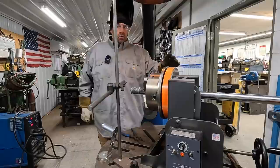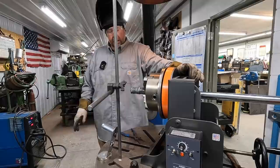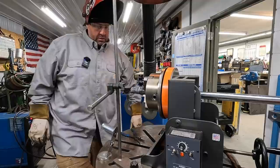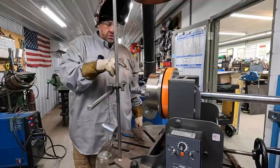I've been getting the AC precision welding positioner set up using a piece of 1045 chrome stock as a sample setup piece. We're using the Miller Matic 251, set at right around 250 wire speed and 18 volts — it seems to be doing a good job. Got the rotation set pretty well. We'll put the shaft in and start getting it welded up — we'll start with the keyway first and then go around the shaft.